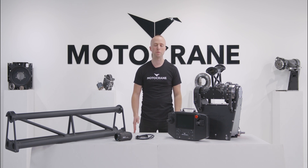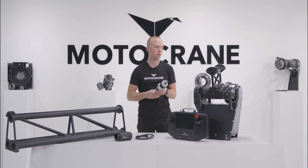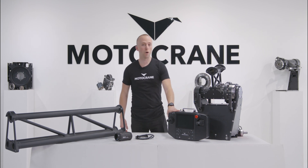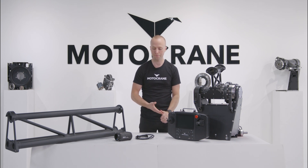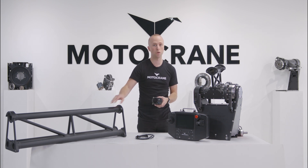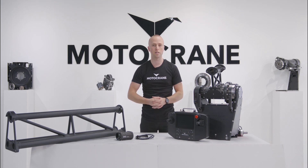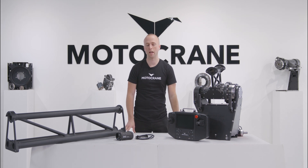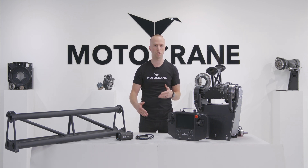INS is really a three-part upgrade to Motocrane Ultra. It includes a new thousand-watt brushless lift motor that we install here at Motocrane into your Ultra turret. It includes a new firmware upgrade for your Motocrane controller which adds a dedicated tuning interface for INS, and it also includes a nine-axis attitude heading and reference system sensor that you mount to one of your middle booms. Between these three parts of the upgrade, lift axis stabilization is improved by about tenfold, which is really important for customers who do a lot of shooting off-road where it's important to maintain arm angle despite changes in the terrain.